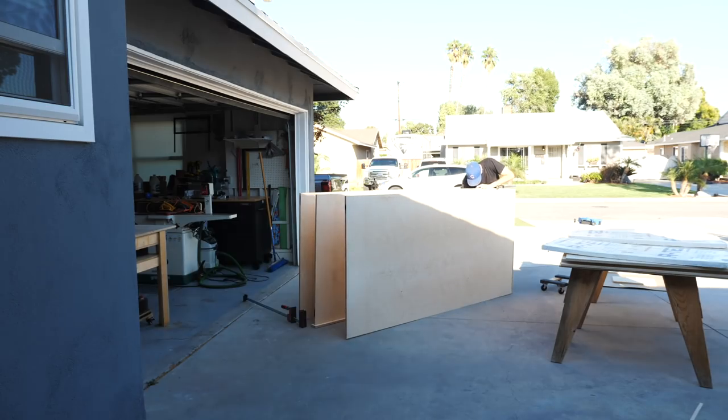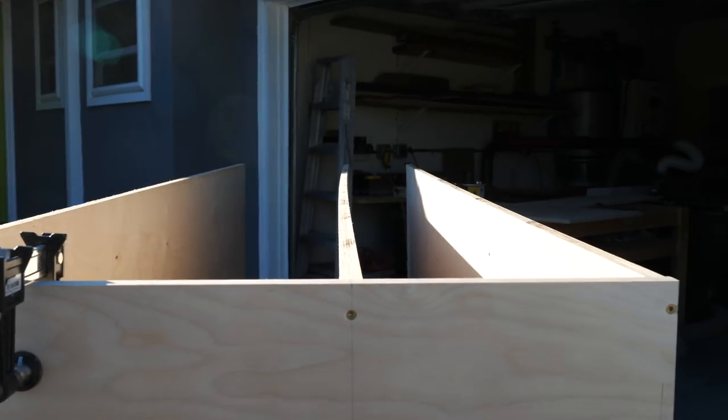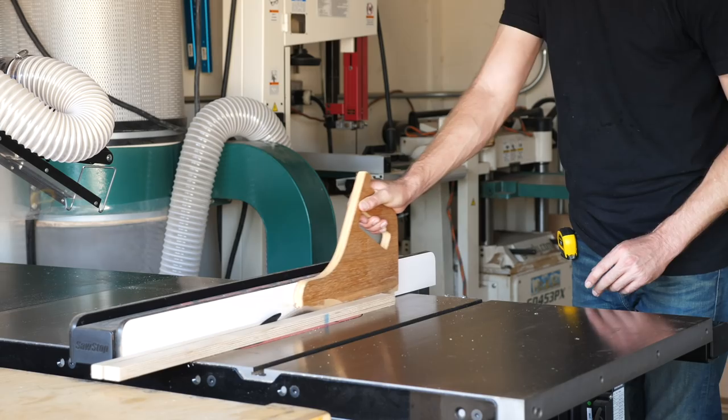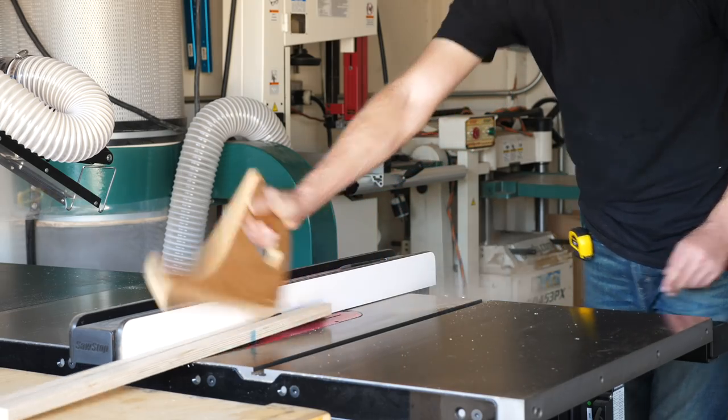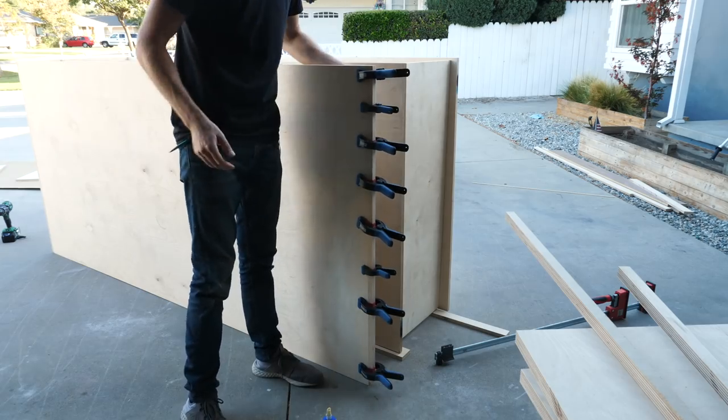In this shot you can see how bowed some of the pieces look right now, but once I get the shelves in that's going to force everything straight. Next I used my table saw to rip three thin spacer strips to go on the top of the sides and the center partition. I glued those in, and after they were dry I could attach my top.